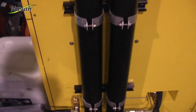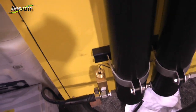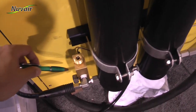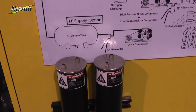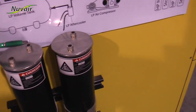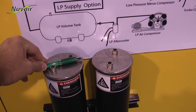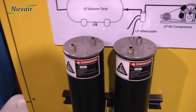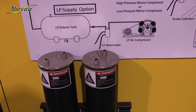Air comes out of your filtration tower here. If you needed to change your filters, you would turn off your unit, bleed all the manual drains, and open the drain here. Then, once all the air was drained out of your filtration, you would put a wrench between these two bolts and turn counterclockwise. You'll notice that there are two different filter numbers: an X65247 and an X65677.